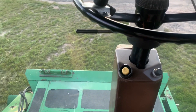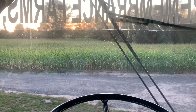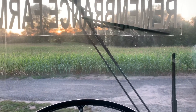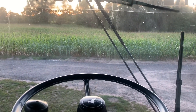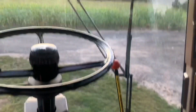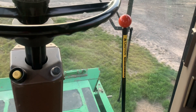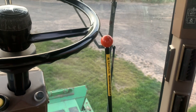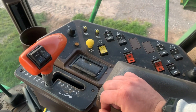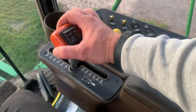Overall this is the view from the cab. This year I'm going to replace my Remembrance Farms sticker out front — it just takes up too much room and is in the line of sight, and that's the most important thing. I don't have the monitor in it right now because it's still in the 8245R. If I were to drive this, the shifter changes gears: neutral, second, and third. Third to go down the road, second when combining. Over here are the controls — if it was a newer combine it would have a lot more electronics, but this is very straightforward. This is your hydrostatic transmission: forward makes it go forward, further you push the faster it goes, same with reverse.